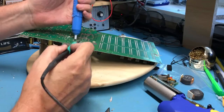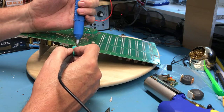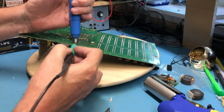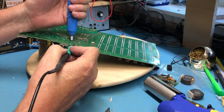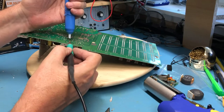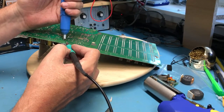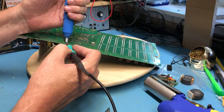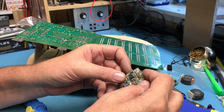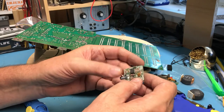Let's see if I can break that other daughter card loose. It's probably not worth salvaging but at least I can get it out of the way. It's on a large ground plane — looks like it did a pretty good job. Probably shouldn't be using the tip I do my day-to-day soldering with for this work, but here's what it is. Looks like a LM393 — some kind of op amp, I assume.